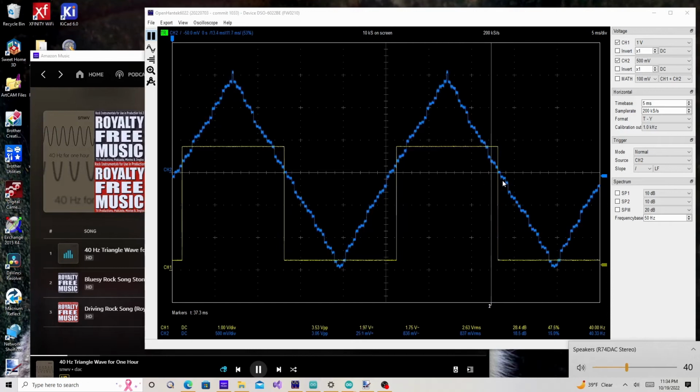Now, this is really stable compared to the sine wave. I have no idea why that would be the case. And that glitch you heard there, that could be the buffer either overflowing or underflowing, and that's a jitter problem. There was a little shift there. That's probably a jitter problem. That could also be a triggering problem. So there's some things to figure out. But I think it's sort of general noise issues that I don't really have a good explanation for. Seems like there's digital noise that I don't have a good explanation for.